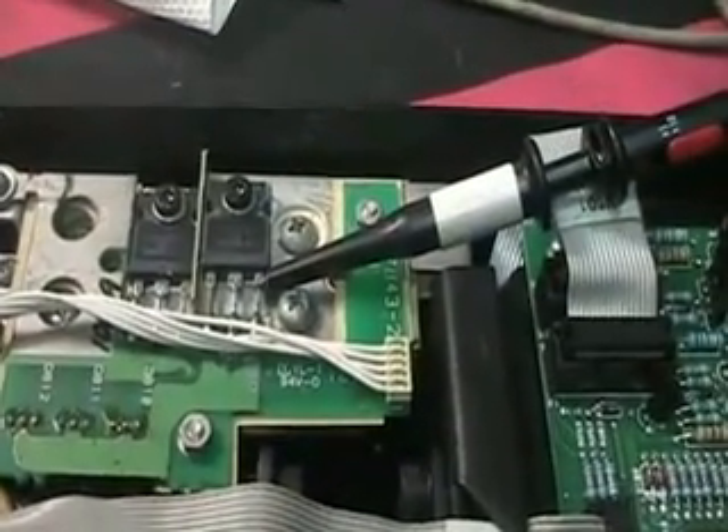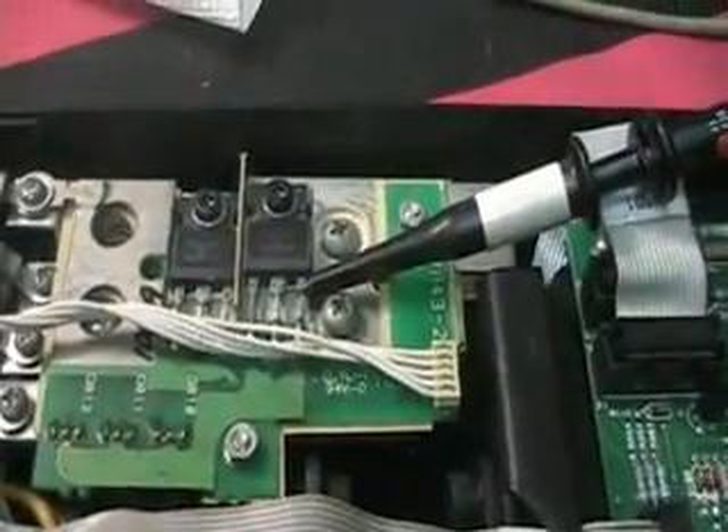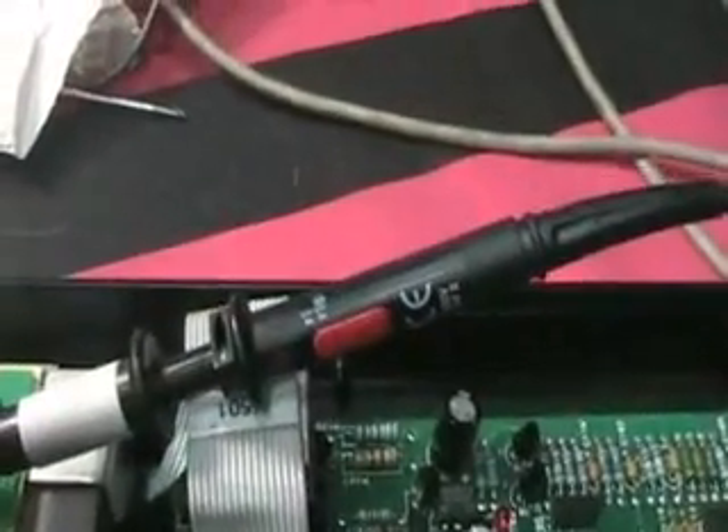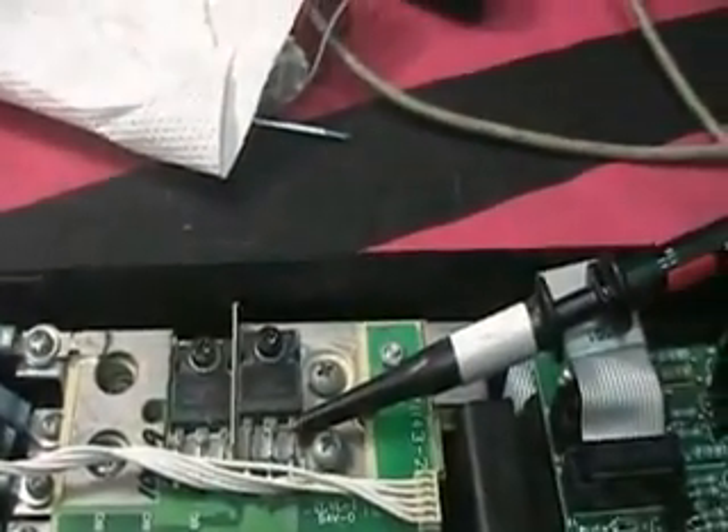Power supply VC switching circuitry. My probe is set at x10, same as the dummy load connection up there. This probe is also set to x10, connected to a dummy load — 4 ohm load.